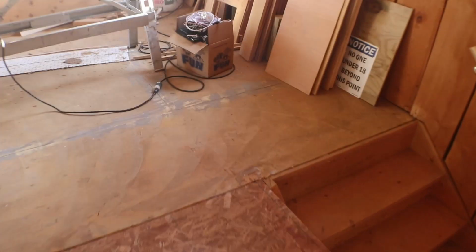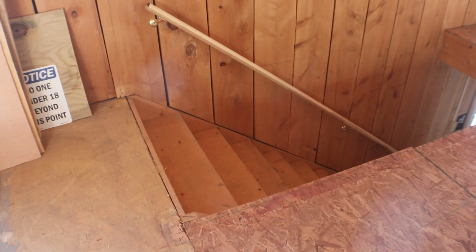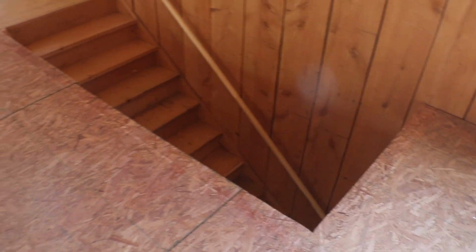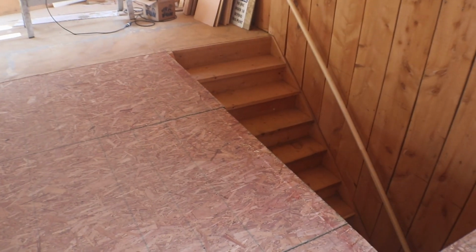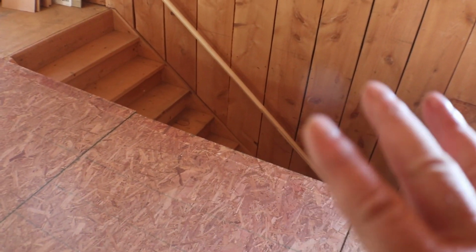Now, if I want, I can go to like 37.5, and that would be, with our cap on the top, making the top exactly 42 inches. That's probably what I'm gonna do. I mean, it's no big deal, 1.5 inches. Is it gonna really matter much? But we'll do it that way. Make our 2x4s, our little studs, 37.5. And I'm also gonna do it 12 on center down through here and the back, just to kind of stiffen it up a little bit more.